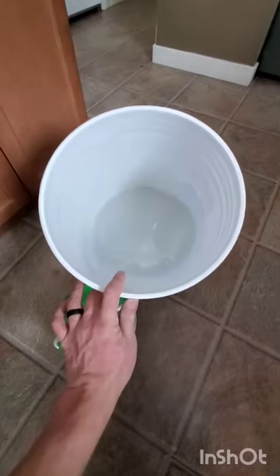But if you wash your tools out in a bucket of water, toss that bucket of water out, because the residue from this quick set mud in that water will cause you nothing but headaches on your next coat. Remember gentlemen, it pays to be handy.